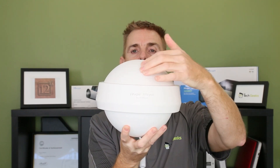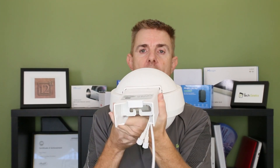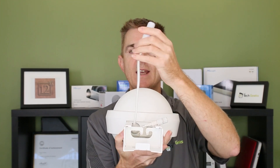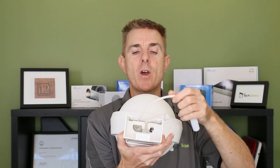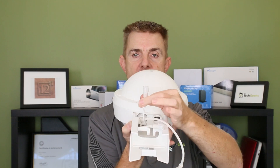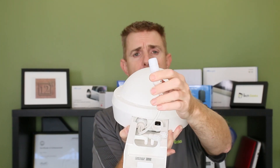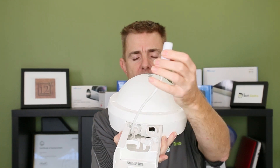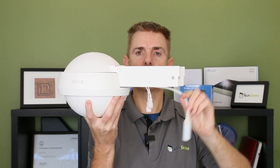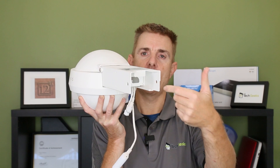On the front there's an open plug we'll discuss in a moment. Here is the ingress for our cables — if I turn it the other way it'll be easier to manage. You're going to get three cables: your ethernet cable that can deliver PoE, a 12-volt direct input for wiring to a battery or similar, and your reset button. That ethernet in for PoE seals for waterproofing. As always, if you're putting this up, make sure you've got a drip loop or it's neatly routed through the bracket and straight into the wall so water runs off and can't travel along the cable.